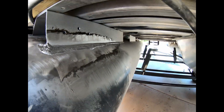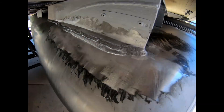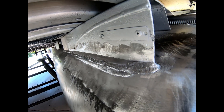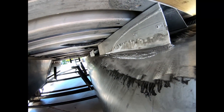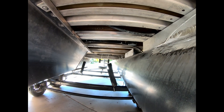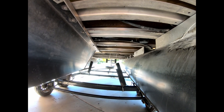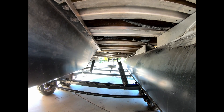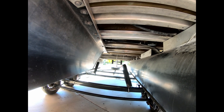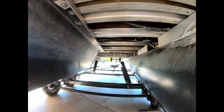From the other side — I think I did all in there, should be good to go now. I'm going to try to put a fitting on it and put some air in it — not a lot. You don't want to ever put too much air in these; you'll blow the ends right out of them. I'll just put a few pounds in it and watch it and see if it holds. If it does, fine. If not, then we'll have to look a little farther.